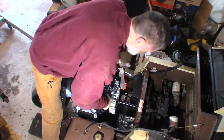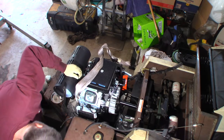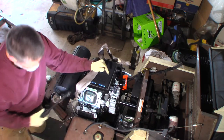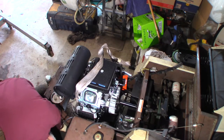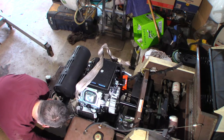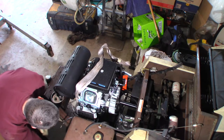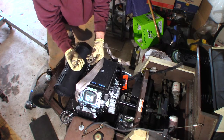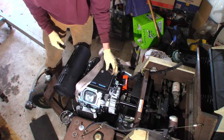I know there's room in there to move, but I think I've slid all the way up and it's not enough — it's got to go a little more. There are four slotted grooves in the bottom of the base plate that give a little front-to-back slide, but I think I'm all the way forward and I'm going to have to take a spacer out. Here's what I have: two spacers and two little washers. I think I'll keep one washer and one spacer — that gives me a little over a quarter inch, which I think will be enough to line everything up.